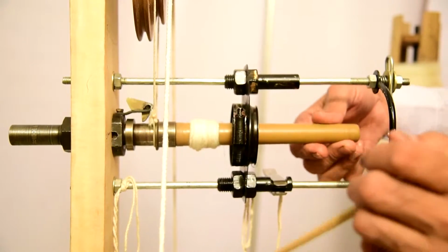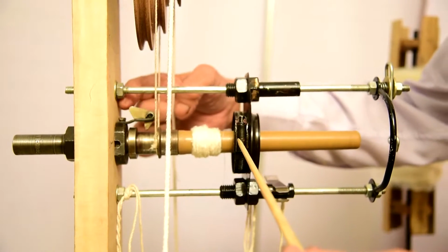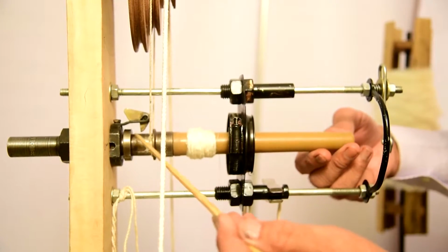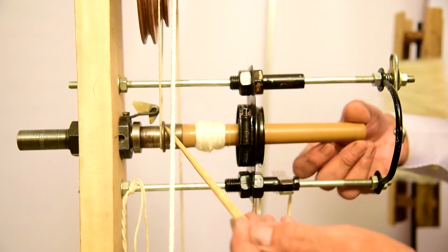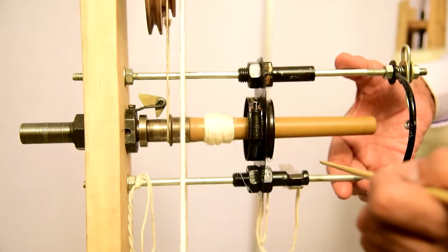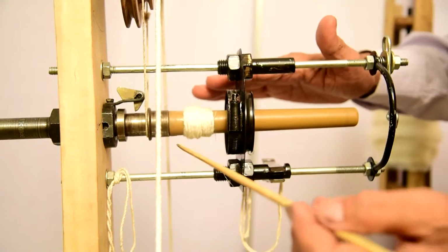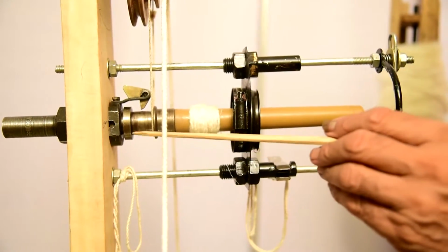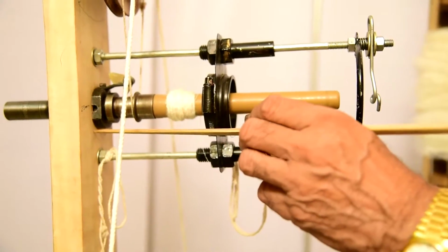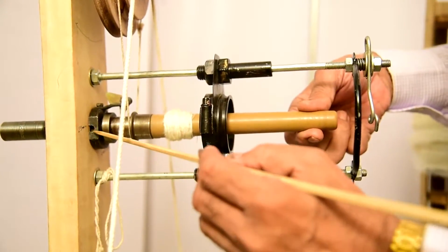This is a spindle, and the brakes. This is a spindle brake. Spindle brake is maintained in between the two collars of the spindle harp. And the entire system, the 8 mm rod, these two rods and the spindle are mounted at 5 degree above parallel to the vertical member. And this will help in keeping the spindle harp and the spindle towards the base member.